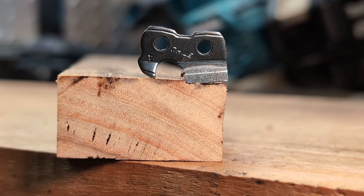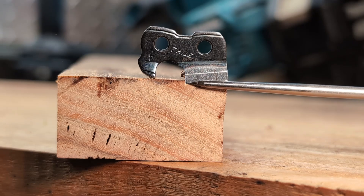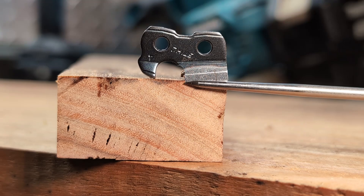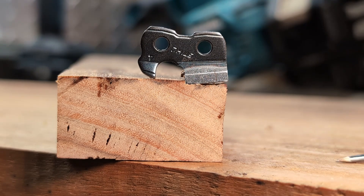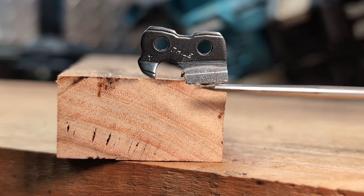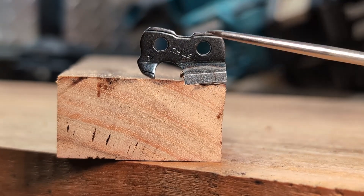If you've ever used a square-filed chain, one of the main things you'll notice is how smooth it cuts. Part of the reason it feels very smooth is it's reducing a lot of the reaction force. The way it reduces reaction force is by doing a more efficient job at severing the fiber. Because there's less of that side plate buried in the wood, it creates less push-back or pull-forward force to the operator. It's also generally a more efficient shape. It's not widely done because it is very difficult to use - I'm not telling you to go and learn this because it was a struggle to learn. Just showing what can change.